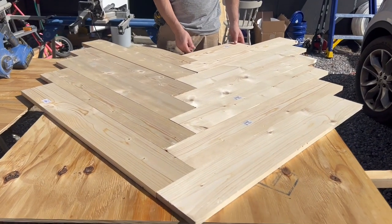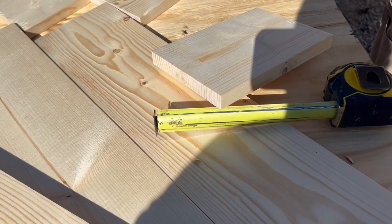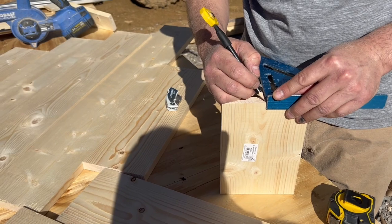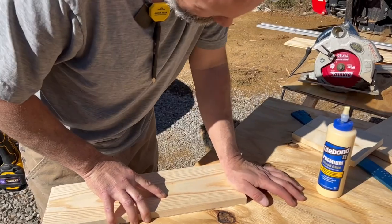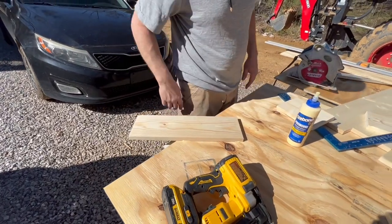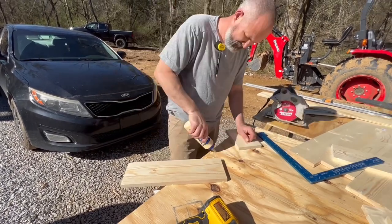Maybe I'm wrong but the center of herringbone looks like it's the center of the zigzag part in the middle. One by six is actually three quarter by five and a half for some crazy reason, so the center of five and a half is two and three quarter. On a 45 degree angle this should work out. Put some glue and then we're gonna pin nail it — get out Penny the pin nailer. Hold it until the glue dries. Don't worry about these edges, we're gonna flip it over and cut off all the flyaways all at once in a minute. One of my favorite things — it's so satisfying to watch. Just do the same thing on the next one: a little glue.